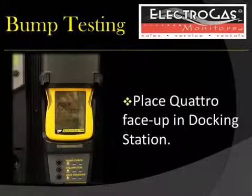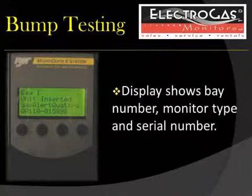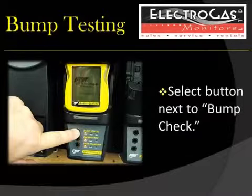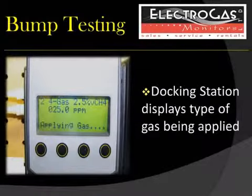First, insert the unit into the station face up and fully close the test bay. The display will show the bay number, monitor type, and serial number. To perform a bump test, press the button next to bump check on the test module. The display will show the type of gas being applied.